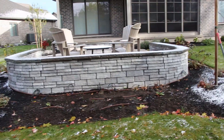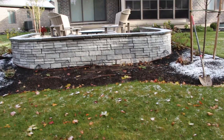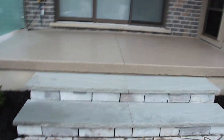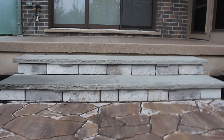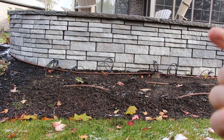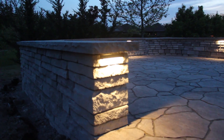To make this raised patio more functional, we turned the wall into a seat wall — extended it up to provide about 16 to 18 inches with nice natural stone caps on top. Wherever I can, I try to get natural stone caps for seat walls and feature walls. For step caps you have to be careful with salt degradation — if the client uses a lot of salt you may want to seal the natural stone. This client is gone in the winter, so natural stone step caps and seat wall caps were the perfect application and really give it a finished look. And with any wall or caps, whenever we can, we throw in some hardscape lighting underneath those caps to give a nice appeal at night time.